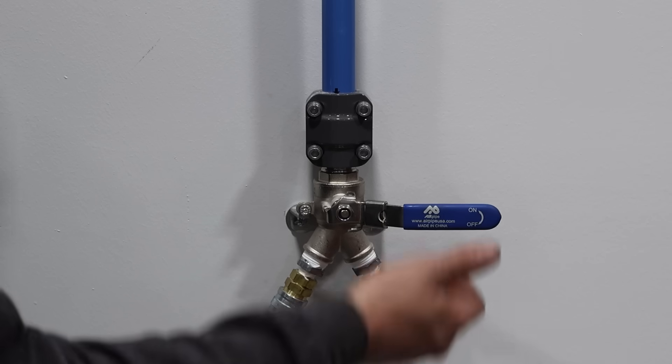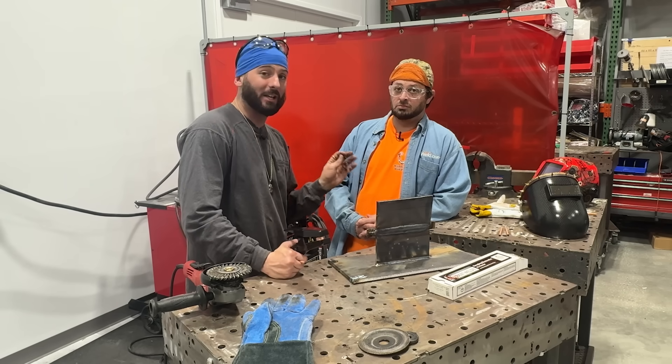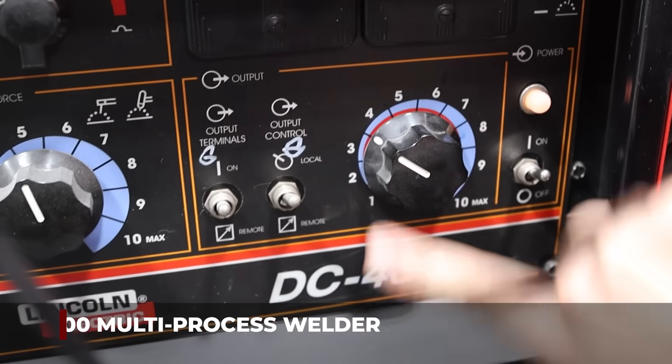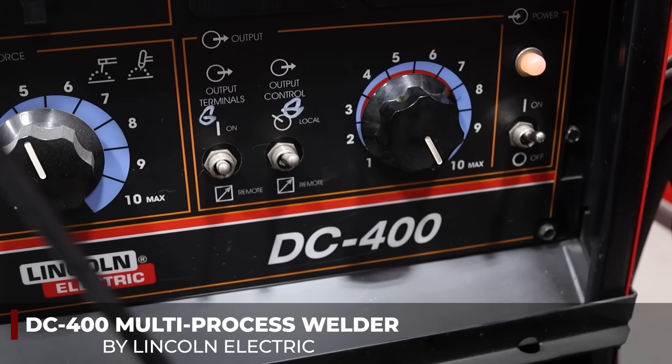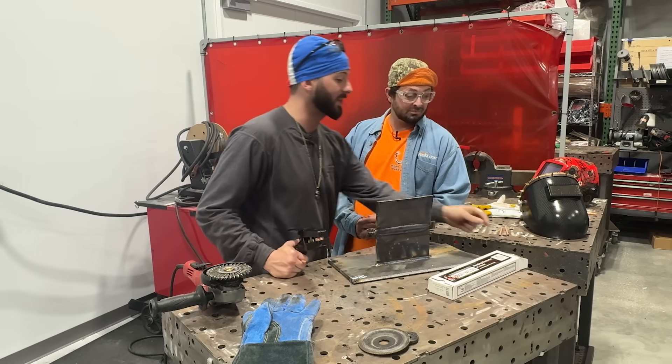We are still going to be creating that crazy arc with this fancy-looking torch right here — the carbon arc torch. It's hooked up to compressed air; it's going to be blowing air out of these little holes, and that's basically going to push that molten metal up and out of the way and get it off the plate. I'm not necessarily the professional when it comes to carbon arc cutting, but I need a big machine and I need all the amps.